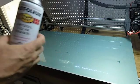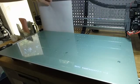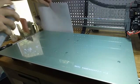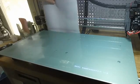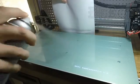I'm using Rustoleum clear enamel here, but I'm sure other brands work. I'm showing the spraying of the bed at normal speed so you get an idea of coverage. A decent, even coat is all I use for the first application. After a few prints, when you notice the enamel has been pulled off the tape, reapply a light coat in that area.